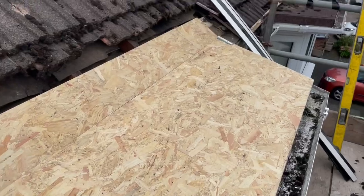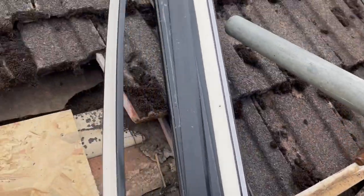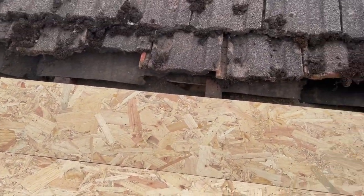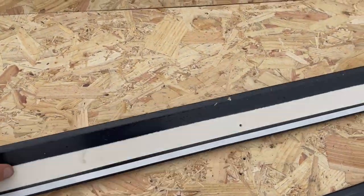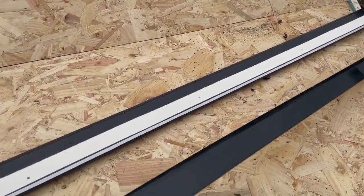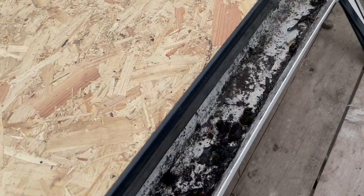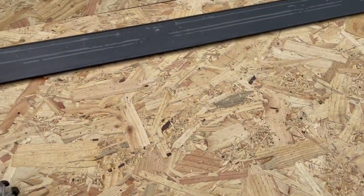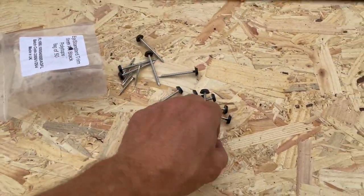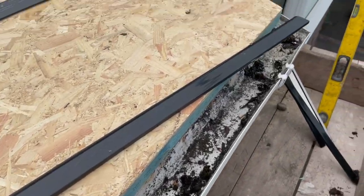All the OSB is down now. Before we start gluing, we're going to fix one part of this two-part drip edge around the outside. This is the drip edge for the EPDM — it comes in one style, though you get different types. You get two PVC trims: the thinner one is going to get tacked around the outside. When you buy it from the stockist you normally get some stainless steel pins — those little pins are going to tack it all around the edge.